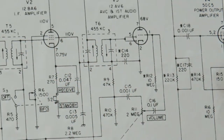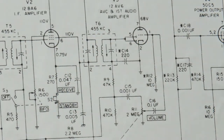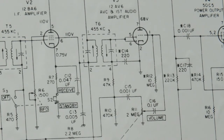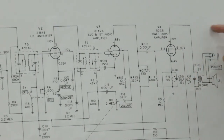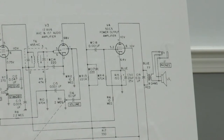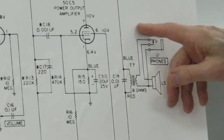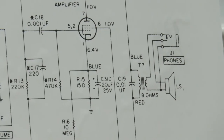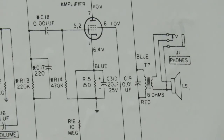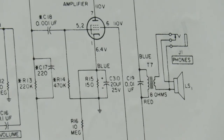Troubleshooting through this thing here, again, with a signal generator, looking at the IF transformers. Those are about the failures. Make sure you have a good B plus supply. I suppose you could have a problem with the speaker, but I don't know when the last time I ever had a problem with the speaker was. And you'd know right off the bat. You'd hear absolutely nothing. If this system were bad, you'd get absolutely nothing. You can test the speaker directly, too. Yeah, you can test with an ohmmeter. Exactly. You can check all sorts of different ways.